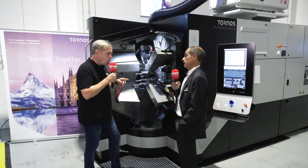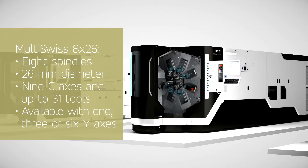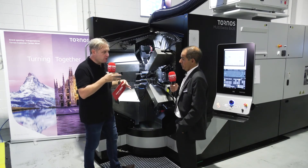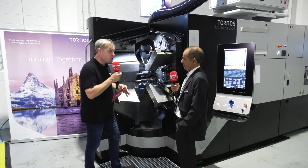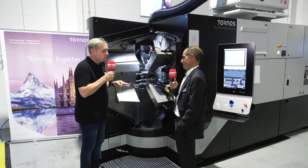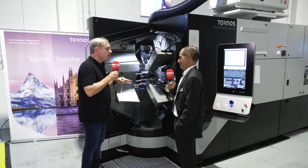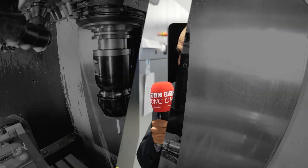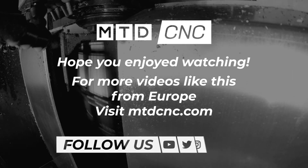Regarding axes — it has Y axis as well? Yes, this machine can go with up to six Y axes, great capability in terms of tools and easy to adjust. And for work on the back, there is a sub-spindle that can work with up to four tools in back cooperation — two live tools and two fixed. Rocco, that's a great overview of the multi-swiss suite — making super complex parts in hundreds, thousands, or millions. That's Tornos Technology. Thank you very much.